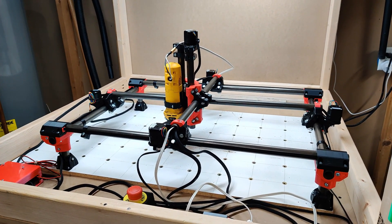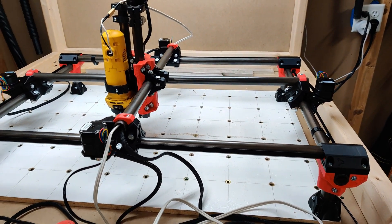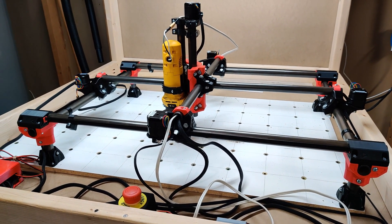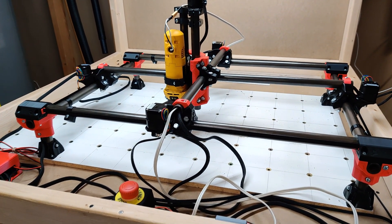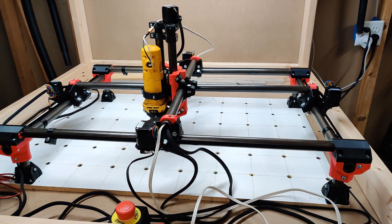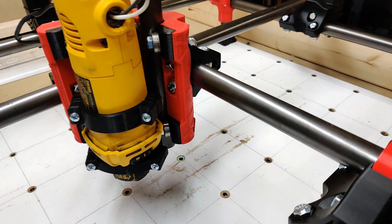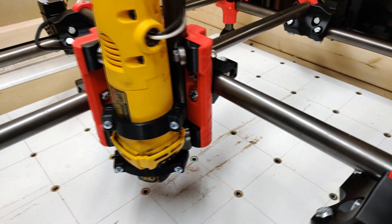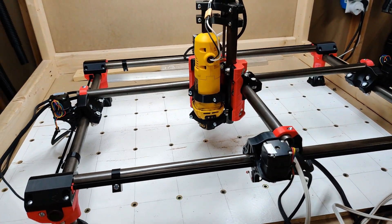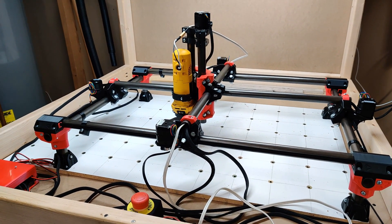It's very reasonably priced, almost cheaper than the conduit for my old build. I kind of wish I would have done this before. This is just mild steel and I have a buddy that has some blackening acid — I'm not sure what it's called — but we cleaned the mill scale off with some vinegar and then coated them with a blackening coating, which is a rust inhibitor. It won't eliminate 100% of rust but it'll be much easier to manage over the life of the machine.